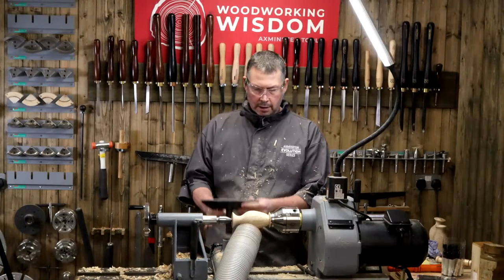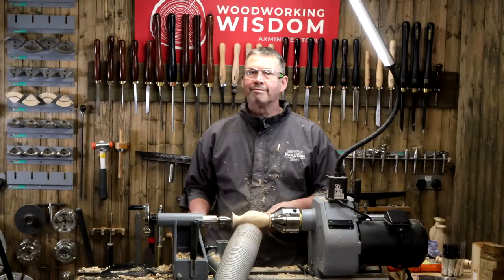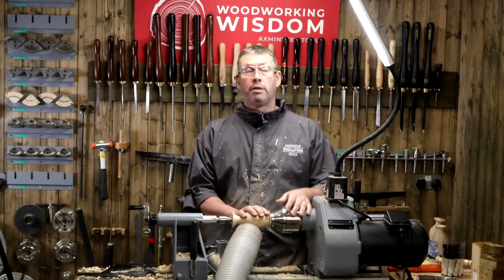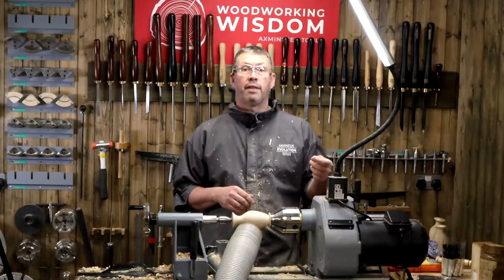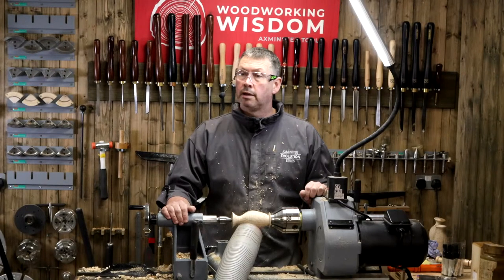Okay, so we've got a few questions coming, Colwin. First one from Jonathan. What's the size of the bead? That is 1/8. So I'm using the small 1/8 cutter. The cutters that I'm using here go up from 1/8, 3/16, 1/4 inch, and then 3/8. Oh, sorry, there was another one from Jim here. He's saying about if you look up through the backside of the tailstock, he's got that same lathe, the threaded section there.